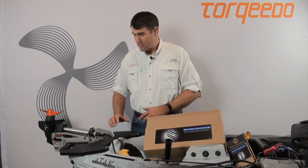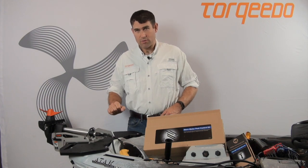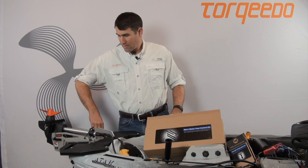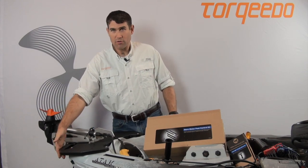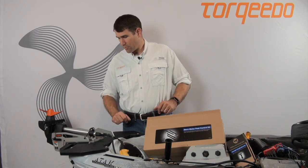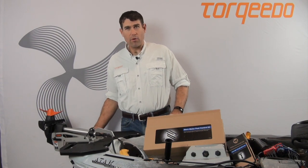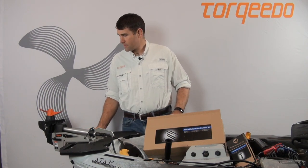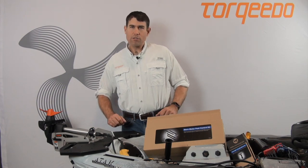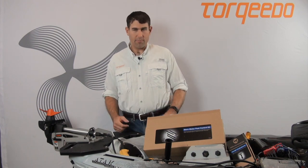Because this stern plate is so large, it blocks access to the handle, so we actually created handles out of the stern plate itself. Having those six attachment points in the threaded inserts is really important because you're actually going to be lifting the boat by the stern plate. We'll go ahead and get into the installation, do some closeups, and show a step-by-step of that process.